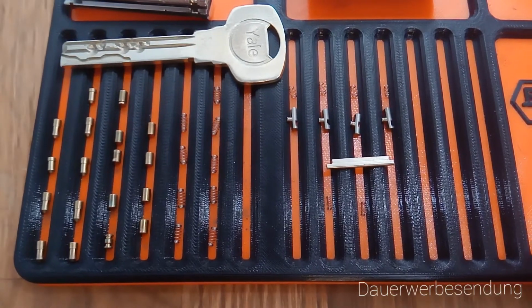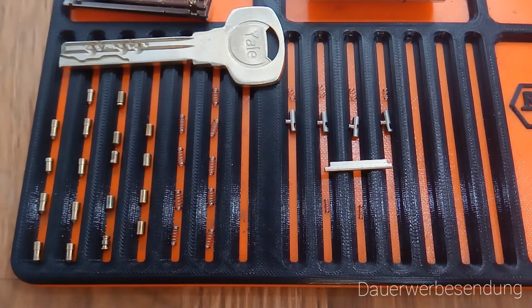And that's basically all. One thing I want to mention before: the sidebar doesn't drop when you align the sliders. You really have to force them a little bit in there, because they are tiny springs, but they generate quite a lot of tension to the sidebar, and yet you need some tension to get the sidebar into the true gates once you've aligned them.